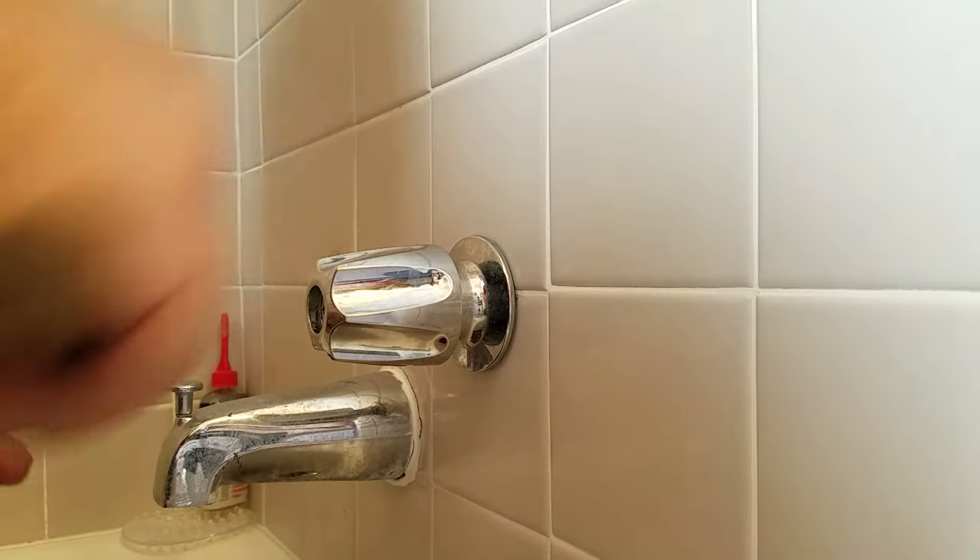I could put this into my tool, but the problem is I can't get one full revolution because it hits the faucet. So what I found is I take my big Phillips screwdriver — as you can see it looks like it's kind of keyed for it — and I carefully go in there without touching the edges and screw that piece back in. Get it just kind of finger tight, pull it back out. Then take the valve seat tool, get in there, and give it just a little cinch — it doesn't need to be really tight. And that part is done.